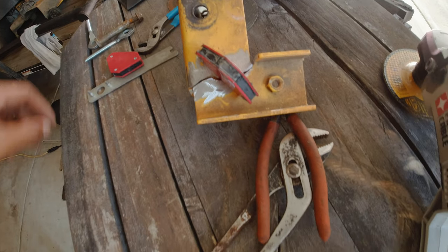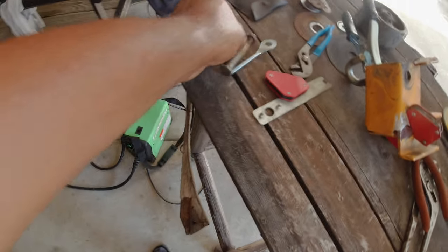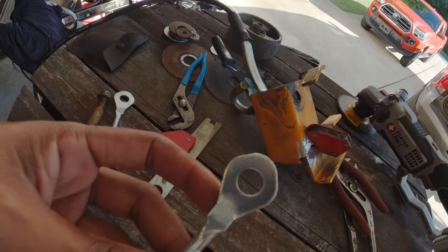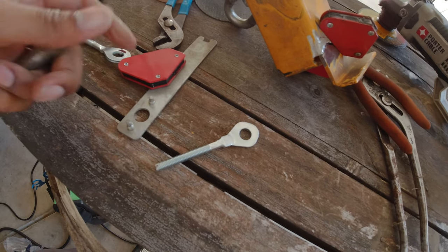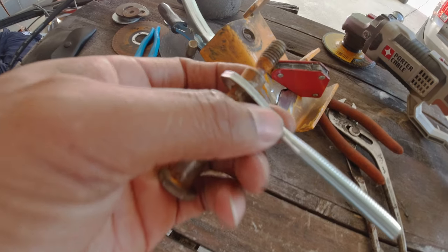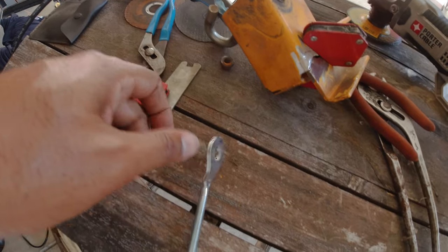And also on top of this, he ripped the hole straight out of the deck where the wheels mount up right here. So I'm going to straighten that out, and then I have these things for the dirt bike back wheel tensioners, which happen to be just the correct size that he needs. So I'm going to just chop the edge off there, straighten it out, and then weld one on both sides, and hopefully his wheel will fit back on.